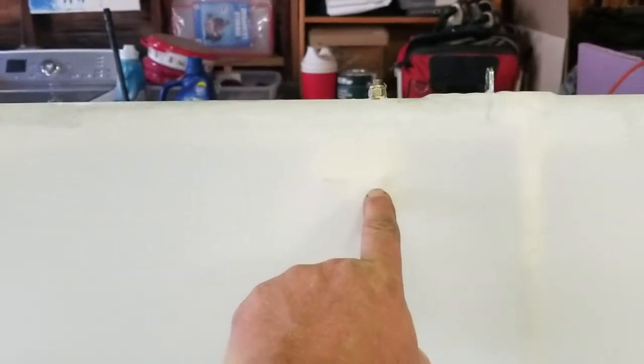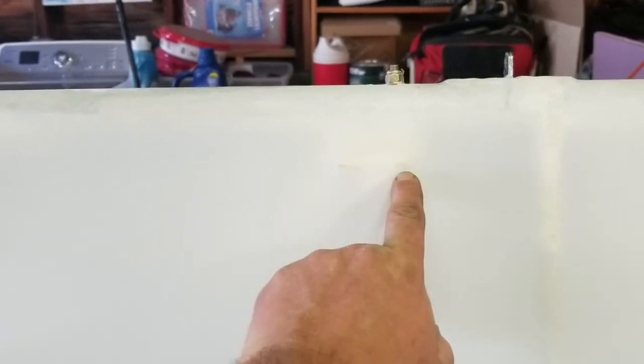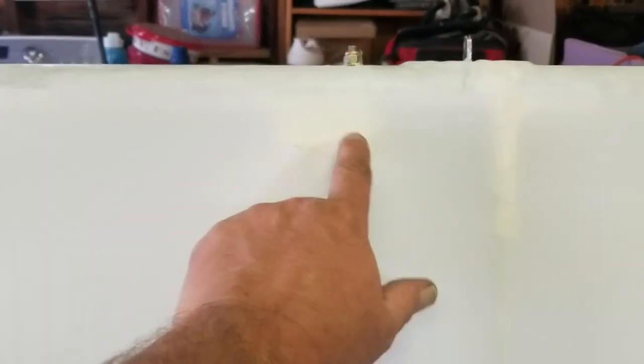Top, bottom, final stretch. Brackets are on and it's ready to go. I will probably have to do a little bit of a fix — I'm going to see how it goes. There are a couple spots where these bolts are touching the fabric. They are taped up with about two to three layers of anti-chafing tape, but I just don't like that. On the second wing, I've elected to grind those threads off and file them down flat, so hopefully we'll have no clearance issues.